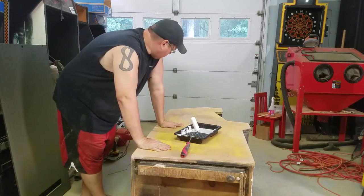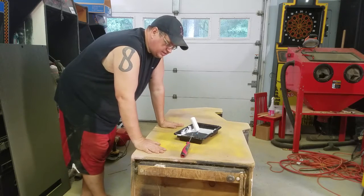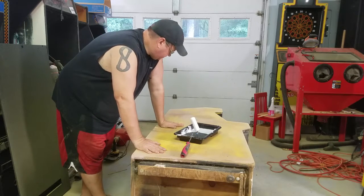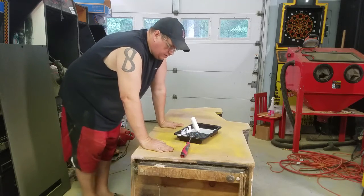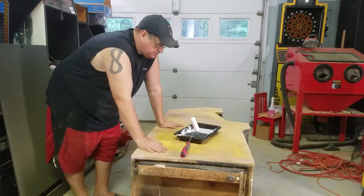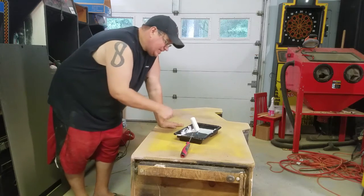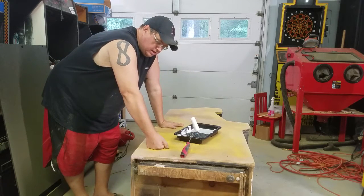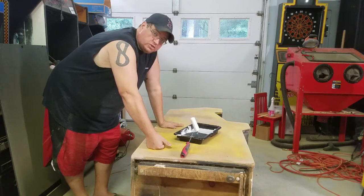Here we go, we're going to keep going and get a good layer or maybe two of primer on this side. And like I said, I'll do the other side off camera. It's just all the same stuff, just on the opposite side. And then in the next video, we'll address maybe that bottom piece there, the front, and just get this thing ready for paint. I'm using Kilz Latex 2 white. I like to use white instead of gray on some of the lighter colors, because this white will make that vibrant yellow really pop.